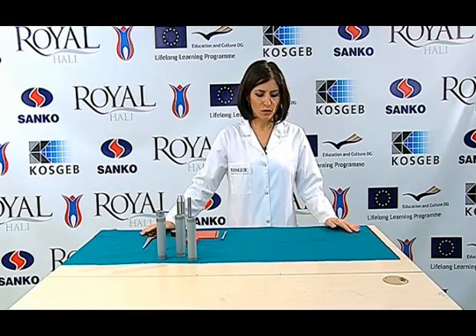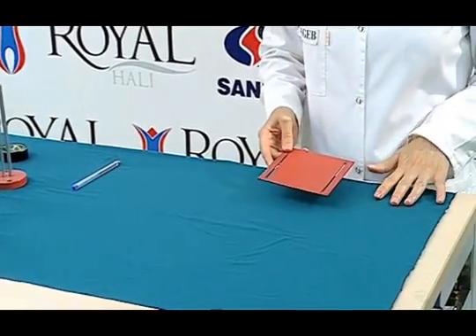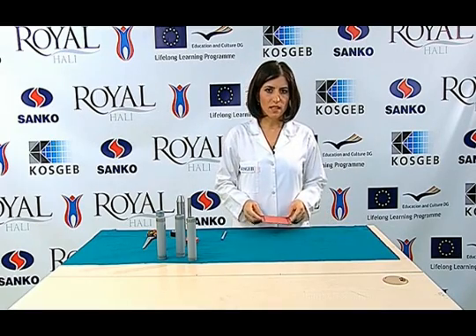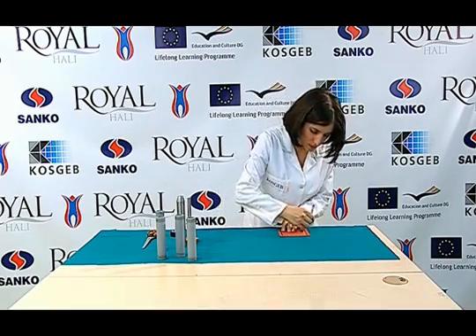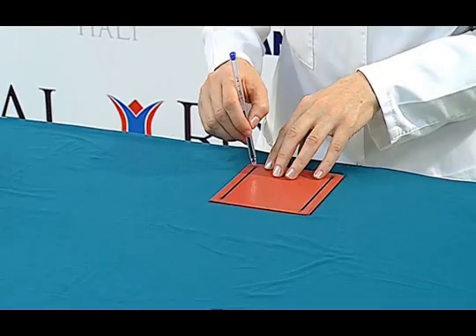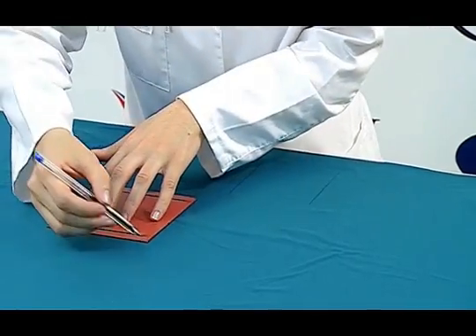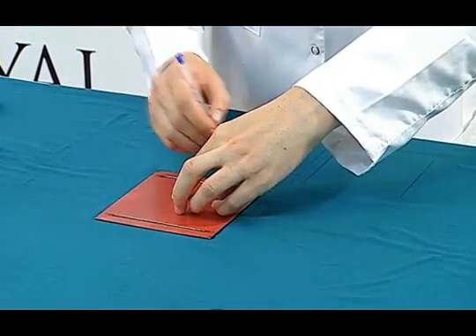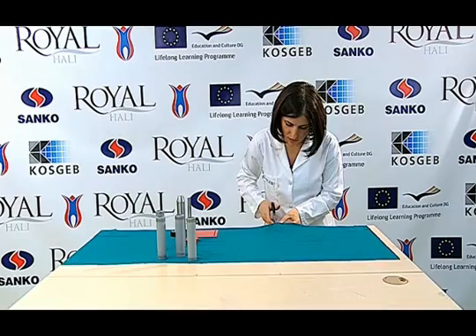We place the samples on the ground inside out and take four pieces of the specimen. 15 cm from the edge of the fabric are measured. We must make sure that there are no wrinkles and no folding trace. In this way, we take weft and warp yarns separately and mark four pieces of the test sample. We mark the edge of the template. After marking four pieces — two in the direction of warp and two in the direction of weft — we cut the marked places properly.